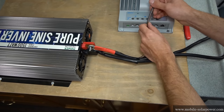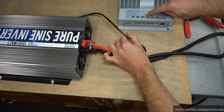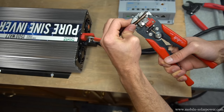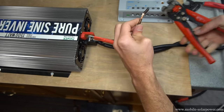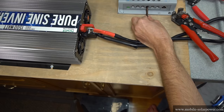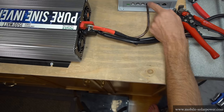Now we need to cut and strip this cable so it fits into the negative battery terminal on the solar charge controller — you will see it depicted by a small battery icon. First measure it and then cut it. Stripping wire is very simple with this cheap tool you can buy anywhere. Then use your flathead screwdriver to unscrew the terminal, tighten it down really well, but make sure that the insulation doesn't go inside — the input terminal should only be touching wire.